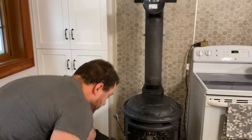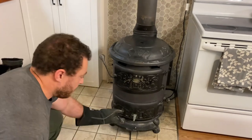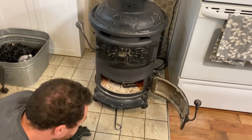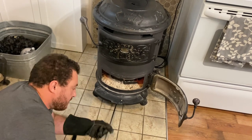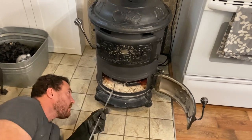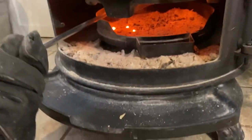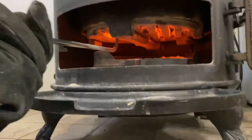Flossing is where you slide the fire poker back and forth between the rotating grate that holds the coal. Well the short answer is no. You do not have to open this bottom door and lie down on the floor to floss. This is what I normally do personally and this is what I showed in my previous video of how to service this stove.